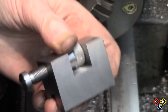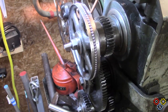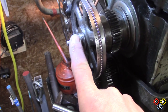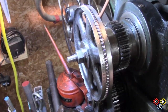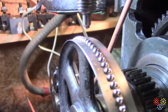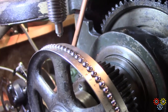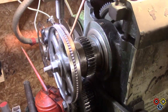Before I disassemble this I thought I'd show you what it's like in situ. That's the expanding arbor tightened up, which holds the index wheel — or gear wheel, call it a gear wheel still. Then the other one holds inside the spindle, and then there is the detent, which has a point and two concave surfaces so that it'll lock nicely between a couple of the ball bearings. So that did the job — saved a mill set up.